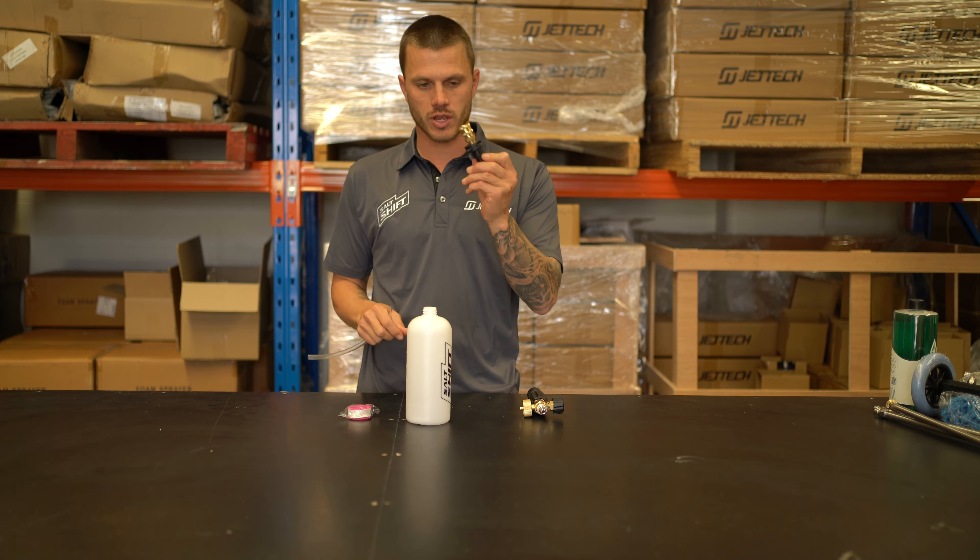Now what you're going to do is get the siphon hose, slide that on and screw on here. With your adapter you'll notice that you've got a quick release and your plastic and brass fitting here. Get your thread tape, wrap that around the thread a few times, loop it up with a couple of spanners and you're away laughing.